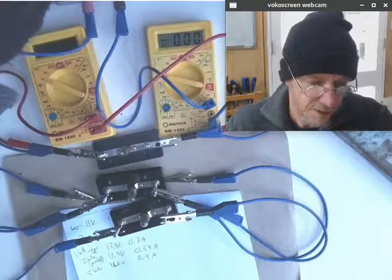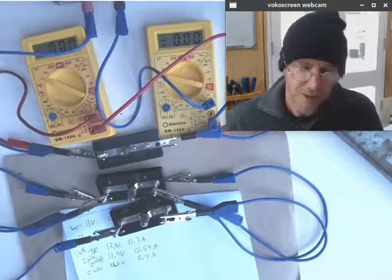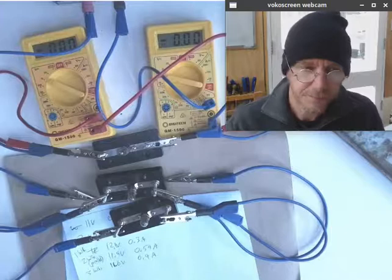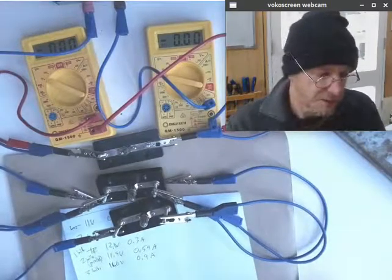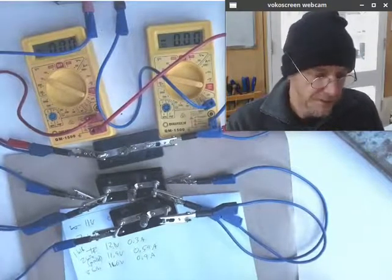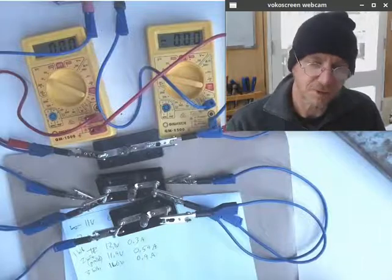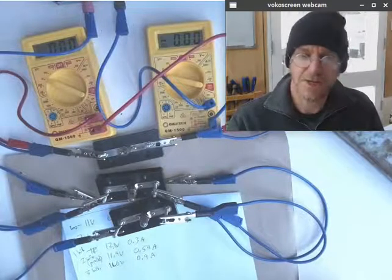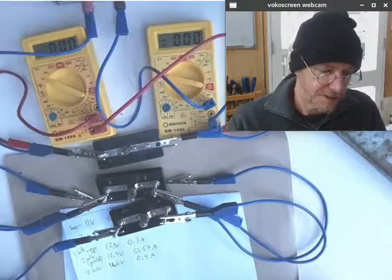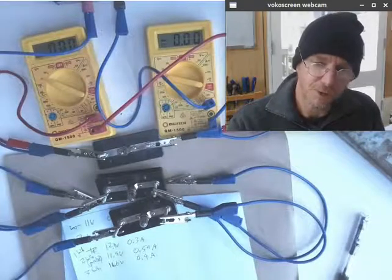And in your house situation, your house is being supplied by power stations that are capable of supplying hundreds of thousands of houses at a time. So when in your house you turn a whole lot of circuits on, or you wire things up, perhaps wrongly, to include very, very low resistances, or make a short circuit by just connecting two wires together, the power supply to your house is quite capable of delivering enormous currents, hundreds or thousands, maybe tens of thousands of amps instantaneously. Now, if we allowed that to happen, then every time you had an accidental short circuit in your house, you would likely melt all your wiring and create a fire.